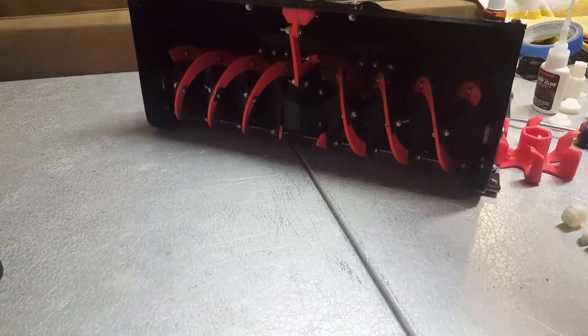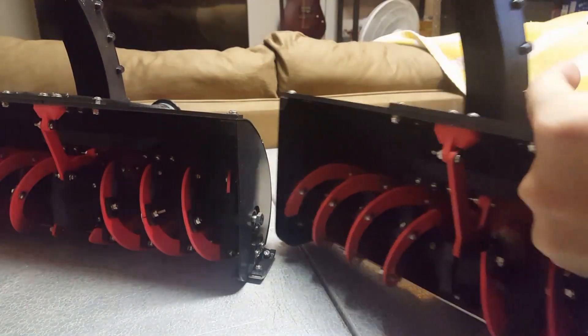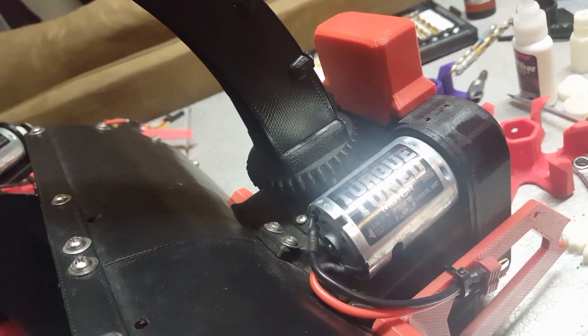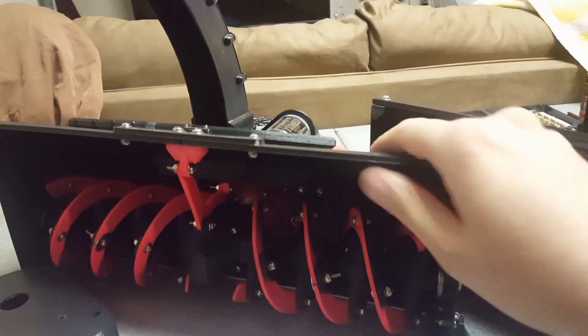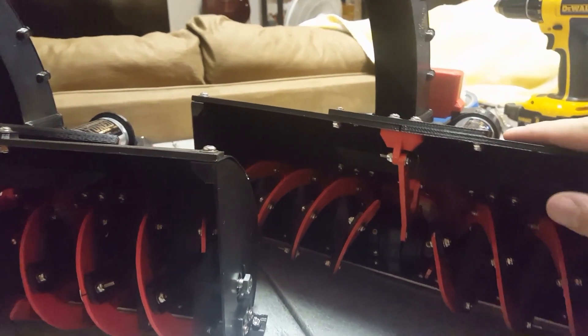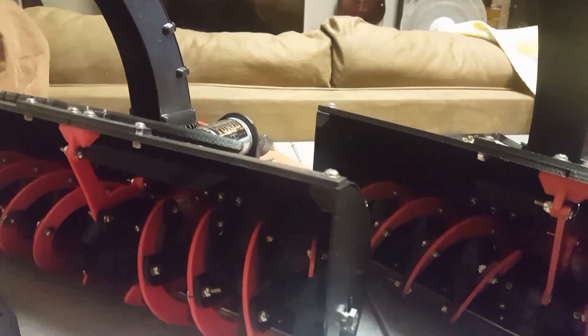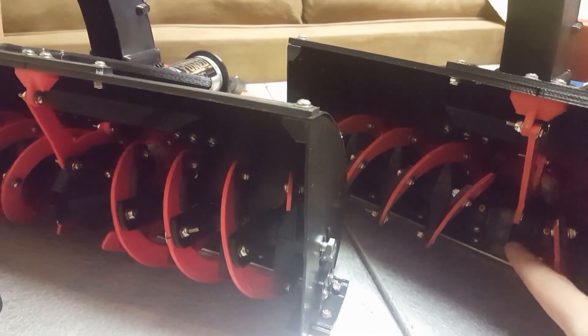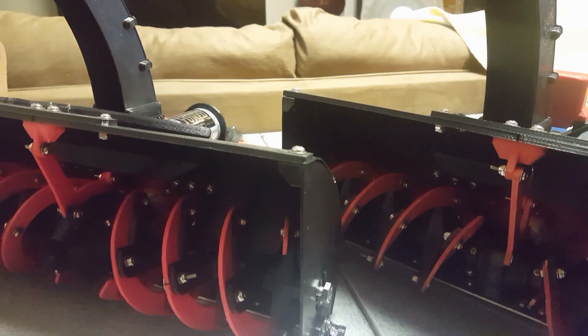With all these upgrades, I basically have two identical blowers — they both have the Tamiya torque-tuned motor installed. I took out the brushless motor that I was running in my main one for this test, so they both have the same flat six-bladed impeller. Both motors are pretty new because this second blower I only used like twice last winter, so there should be the exact same performance — the only difference is the new transmission, the old Traxxas diff versus my new Delrin gear one. My test was to put them in a bucket of water and pump the water out and see which one is quicker.